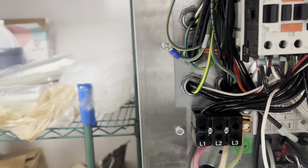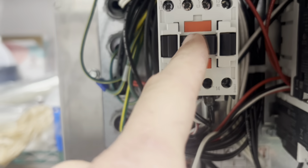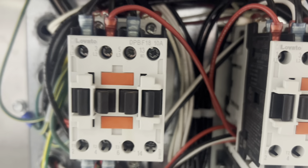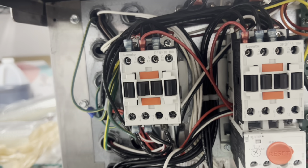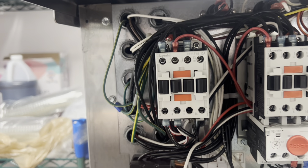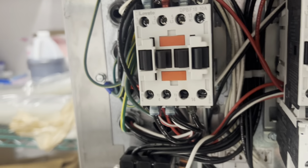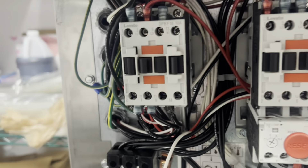What I'm going to test is: this third circuit is what's dead, and I'm curious if it's only the third circuit. I've done this on another Electro Freeze ice cream machine with the same setup — I just moved it over to the fourth set of terminals and used one, two, and four. So I'm going to kill the power, unhook my load wires, and test continuity across. If I have continuity on one and two without any odd resistance, I'll check four.